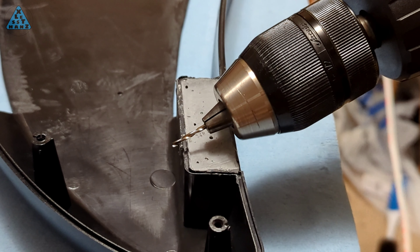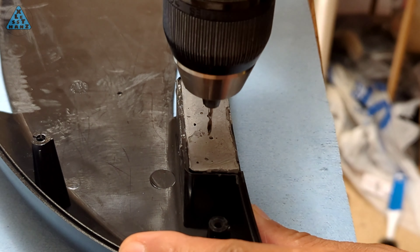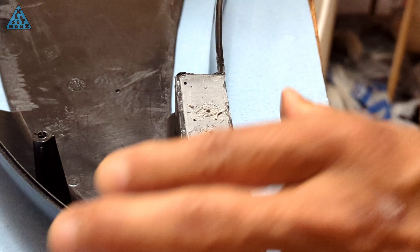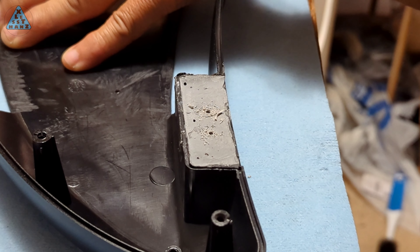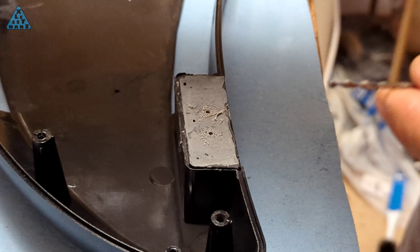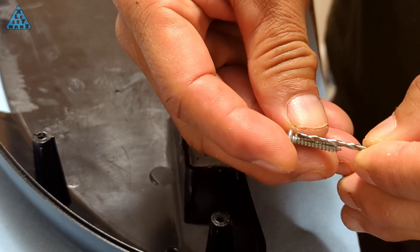In drilling the pilot holes, I usually have a small drill bit that I use with number 6 by 1.5 inch screws in wood. I could not use this same drill bit for the pilot holes in the JB Weld — the glue binds up the threads of the screw and it becomes impossible to turn. I ended up re-drilling the pilot holes using a 9/64 inch bit. Along with that, I had to wax the screws so that they wouldn't bind to the JB Weld.